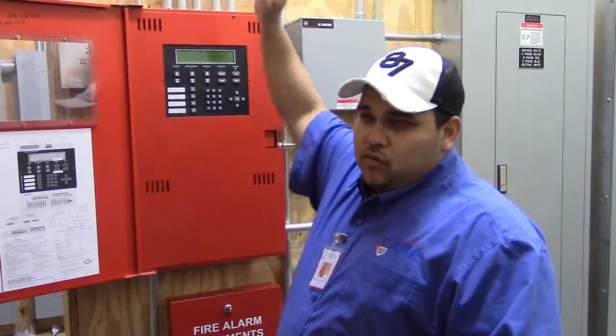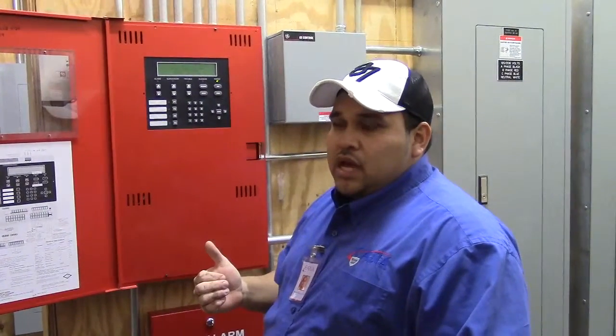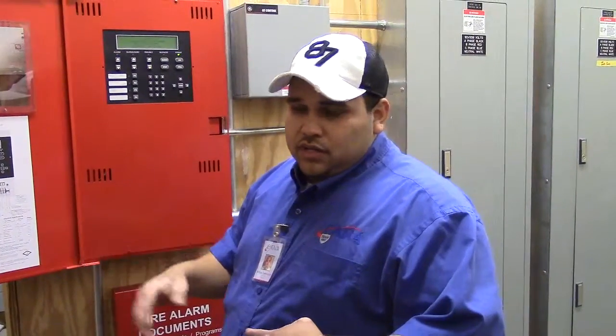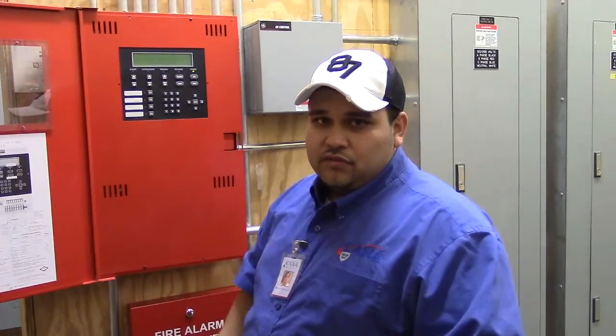Above the panel you have one on the other side, and you have a corner grille. You have the kitchen hood system — if they were to pull the kitchen hood trigger, that would trigger the alarm. Same thing with building 6000: you have the only restaurant there, which is Ted's, so anything that goes off in Ted's will trigger the alarm there. In building 6000 you have one detector in the lobby on the first floor, one in the second floor lobby, and pull stations in every exit.